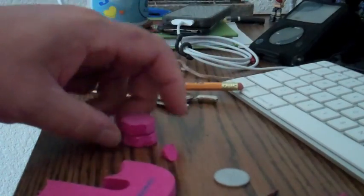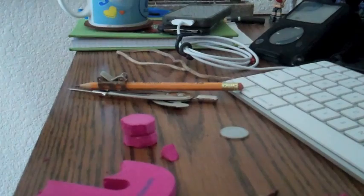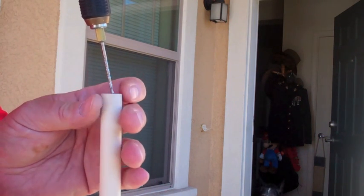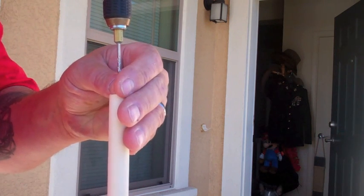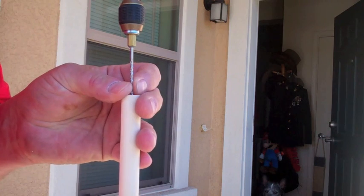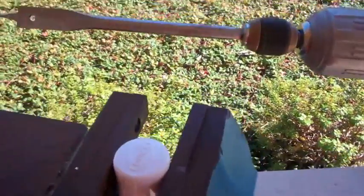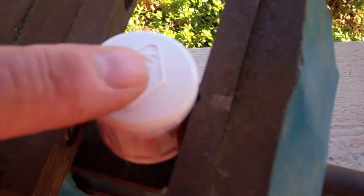At this point I want to find the center hole in these two foam pieces. I'm going to drill the hole into the end of the dowel. I'll measure the dowel later, simply because I want to get the rubber pieces on the end of it first. Make sure you're drilling a good straight hole. Then drill the half inch hole in the center of your cap so that the dowel can fit through it.